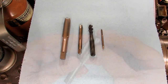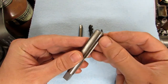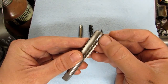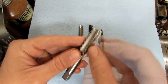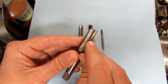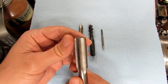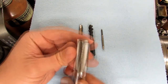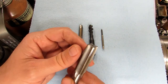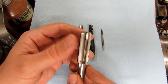There are also tip styles to consider. The first is the taper tap — you can see how much taper there is at the front; it doesn't reach full thread diameter until about five-eighths to three-quarters of an inch from the end. These take the least amount of torque to cut, are generally good for through holes, and can be used to start a hole especially in harder materials because the lower torque requirement means you're less likely to break the tap.